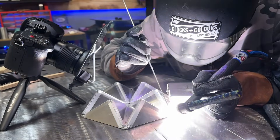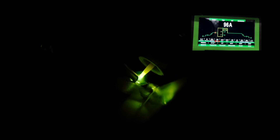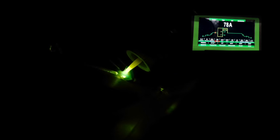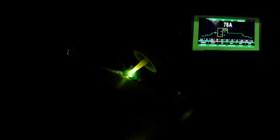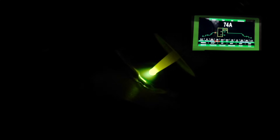Again I'm starting on the outside just like I described, with a bit of an uphill, making sure that I use adequate heat and adequate filler material. You do not want to let things overfill — this is going to block penetration into the base material — but you also want to make sure that you use enough filler. If you don't use enough, the heat input is going to increase rapidly especially going uphill, and if this happens you are going to cook this project very quickly and it's going to look like trash. As I'm working here I'm bouncing around from side to side, really letting my heat disperse as I work around it. You can also take breaks and let the piece cool down after each stage.